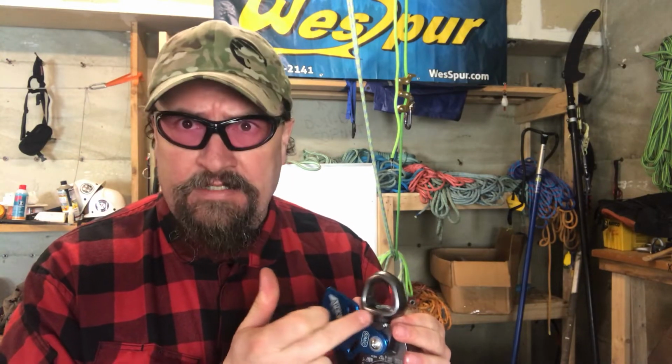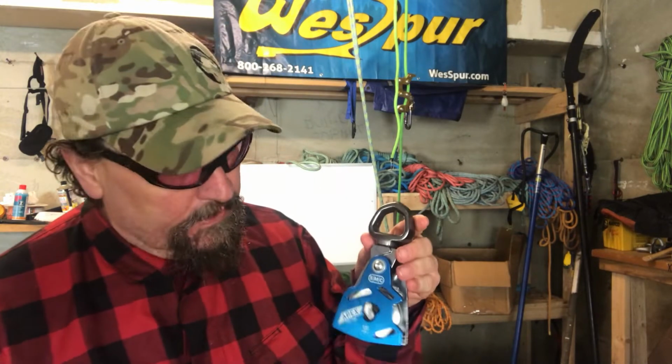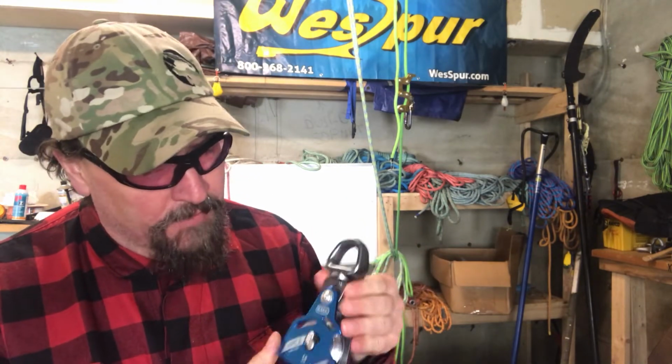So this pulley has a MBS of 38 kilonewtons. That's given us 9.5. Let me double check that. Yep, 9.5 on your working load limit. That's here at the anchor. Obviously split that in half for each leg of rope. They're running a 4-to-1 in that assessment of the working load limit. So just keep that in mind.